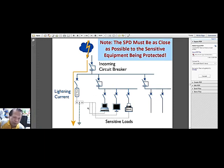Usually these appliances, devices or equipment convert the AC to DC, and of course, because they only work at a very low voltage, they are prone to damage by lightning charges. The non-sensitive loads like lighting, the electric fan, or other motors that are not provided with electronic sensing or protective equipment usually have the capacity to absorb this lightning charge.